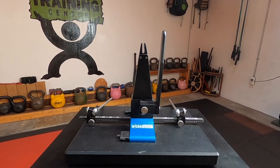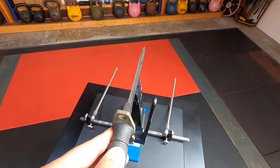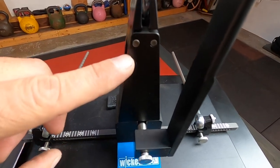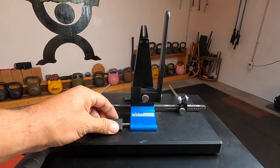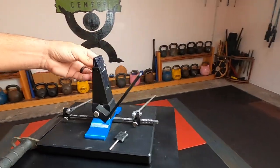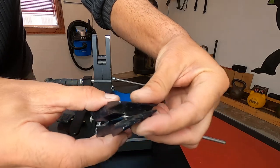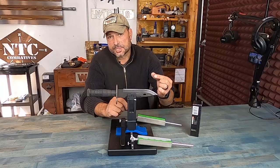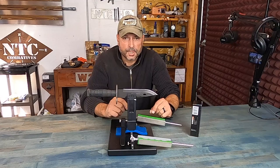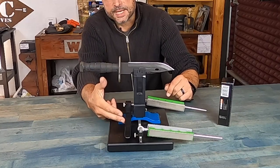The first thing I had to do was replace the current jaws on my Wicked Edge sharpener with the new ones that would accommodate the quarter-inch blade. It's a fairly simple process, just utilizing the tools already built into the sharpener. I was able to pop out the two little metal rods that hold the jaws in place. Be careful to preserve the little spring in there that separates the two jaws. By pinching them up on top and lifting them out straight, you're good to go — put them down, and they tend to stay in place as long as you don't drop them.